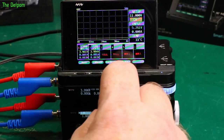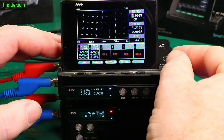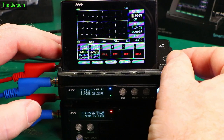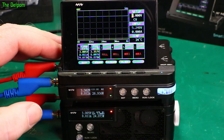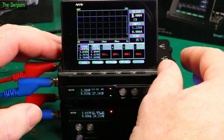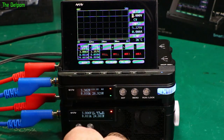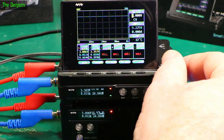Constant voltage mode - this will adjust the current to try and keep the voltage at that set point. It's putting down to 3 volts right now. The power supply is set at 4 volts, so it's drawing a lot of current. I've also dropped through these cables to get 3 volts, and that's drawing 24 watts right now, 8 amps to do that.